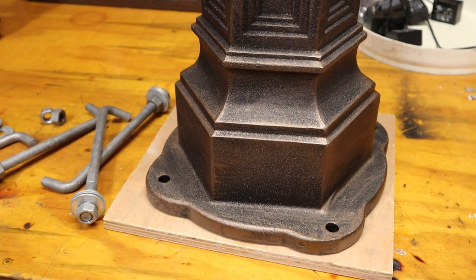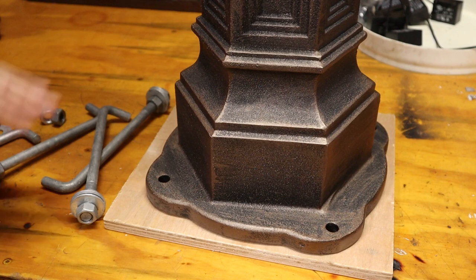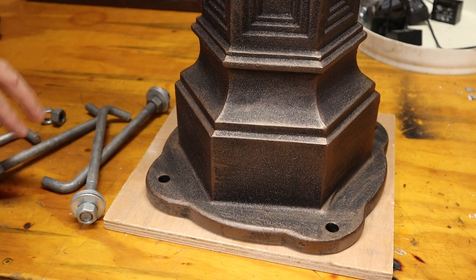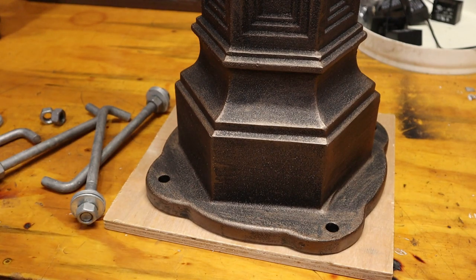So we have to make sure that this bolt pattern is dead on, because once this is set in concrete, that's it. I mean, they don't make a bolt mover. So we're going to have to make sure our bolt pattern is spot on. Again, I can't take credit for this. This is all detailed in the description for this product on Amazon. We're going to drill some holes in this plywood. We're going to use this plywood as a jig to locate these bolts in the concrete.